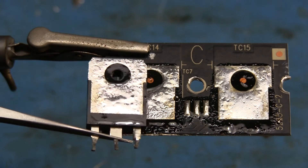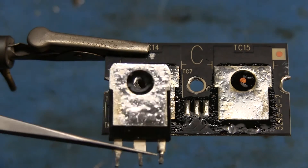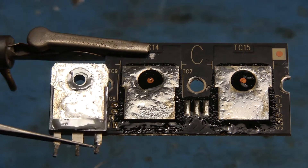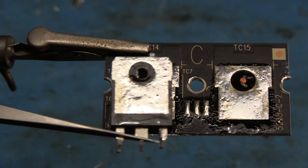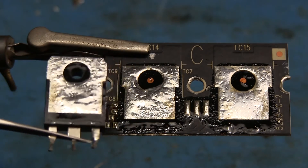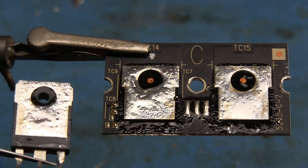Now that this component is out you can see that the pad on the thermal strip has the exact same shape as the plate on the MOSFET. What that does is when you put the new one on, after cleaning off the old flux and adding some fresh flux and a little bit of solder, once you heat this up enough for the solder underneath to melt, it pulls the part right into place and aligns it. So it's pretty much spot on where it needs to be — the molten solder and the flux do all the work for you.